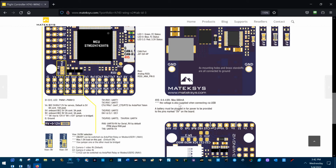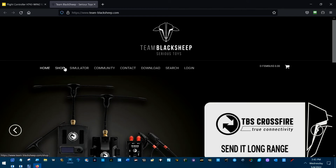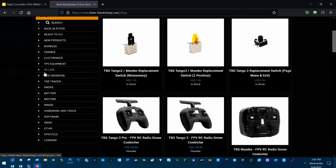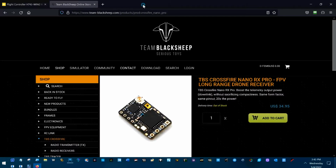So we're going to push that aside, and we're going to say, in this perfect world we're in right at this moment, this board puts out exactly 501 milliamps, and 501 will blow it up. Well, that means probably I could put that full load of the 500 milliamps of the Nano Pro. Now, let's see if we can go over and look at the Nano Pro specifications, if we can find that anywhere. Because truthfully, if it's going to transmit 500 milliamps of power, there's some overhead for some other things.